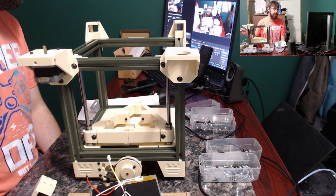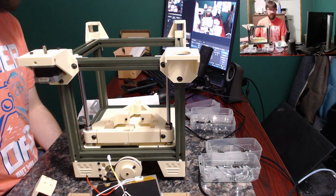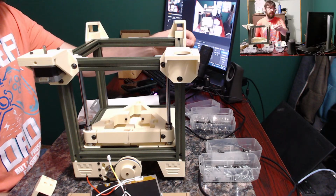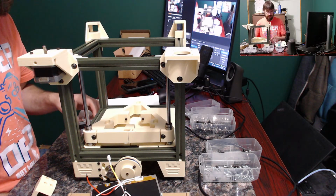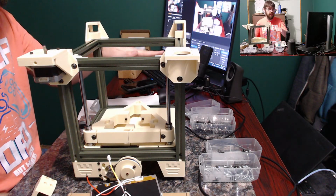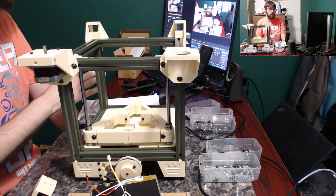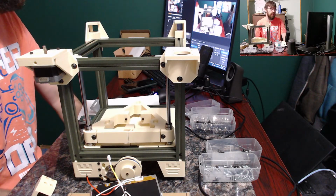I was building Cappy, and actually my Panda build that is printing right beside me, fully assembled. If you move the motion, you can feel the actual out of roundness on the motor shafts and the bearing and the pulleys. When you slide the gantry back and forth, you can feel it as it goes around the non-concentric part. So if you want really nice print quality, I highly recommend your X and Y motors are Stepper Online, or get some LDO motors if you can.